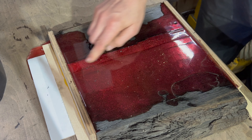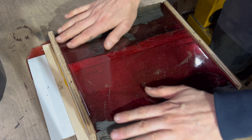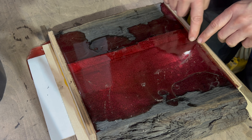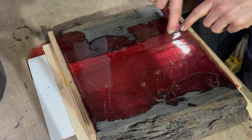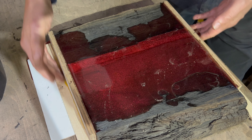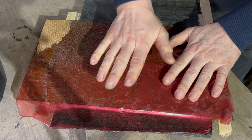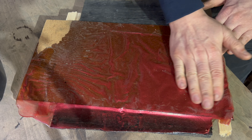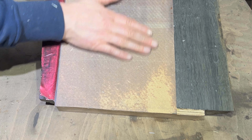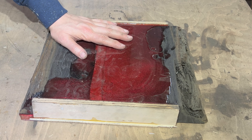It did mean that I needed to top this up after it initially went off, and it spread — it's gone down a lot of these cracks here which is what I wanted, and down the side crack here which is where I think the leak stemmed from. Going to trim up next to these and then run it through the planer to get rid of this, in very small increments because planers generally don't like resin. Successfully planed that off — it's nice and flat now.